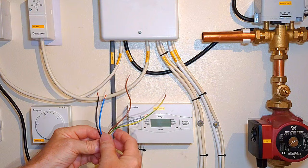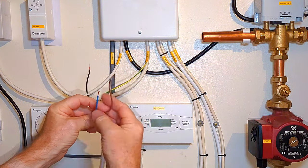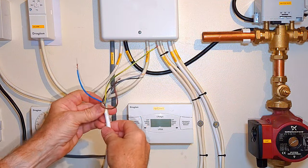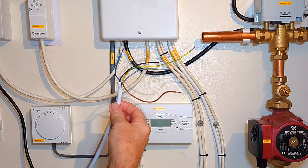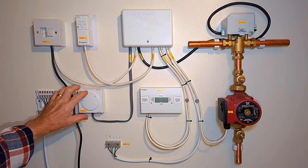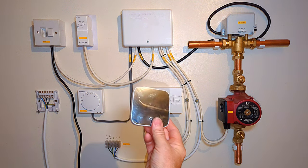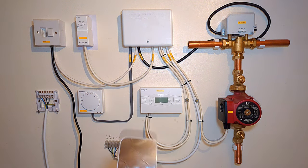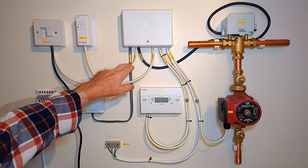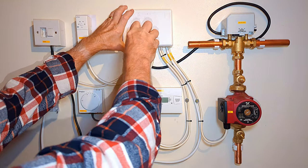I could also wire it into the programmer because all the connections I need are in there as well. I have a live wire, a neutral wire, switch wires on black and gray, and an earth wire in green and yellow. The earth wire is just to protect the flex in case it gets damaged. But first we need to remove the room thermostat and see where it is wired in - that's if you have a room thermostat - because we're going to be replacing it with the Hive wireless thermostat.